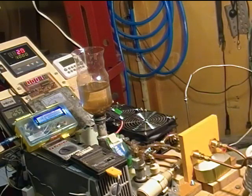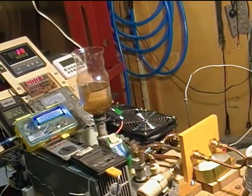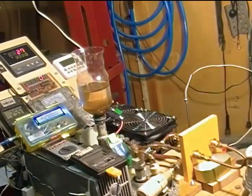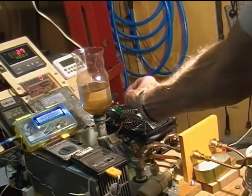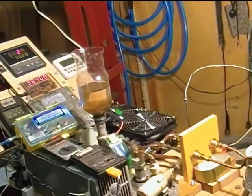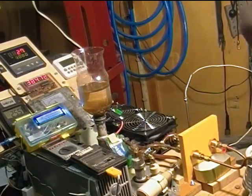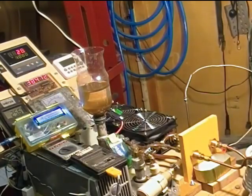Everything's on. We're going to check to see if the DC-to-DC SSR protection circuit works. The DC SSR is behind the panel here. I'm first going to turn the current on with the breaker, and we see we have 6 amps on the analog meter but only 2 amps on the Arduino display. There's a non-linearity between the two at the low end of the scale — I'm not too sure why it is, but it works fine in the software up where we need it to.